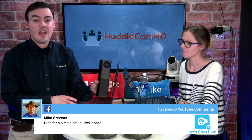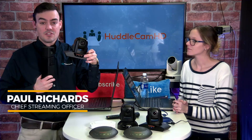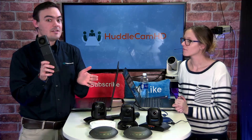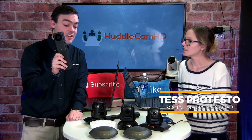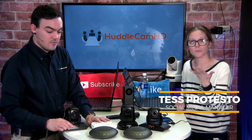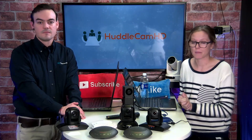The difference between our 3XA and 10XA cameras and the HuddleCam Go is that these cameras require a power supply because they have a motor for pan, tilt, and zoom. The HuddleCam Go is very simple — great for home use because it's USB 2.0 and it handles power, video, and audio all over a single USB with no need for a power supply. These cameras will appear in your meeting software as a webcam and the microphone will automatically appear as well, just like a separate microphone.